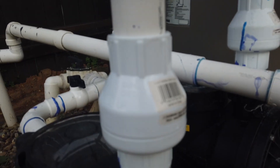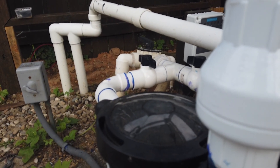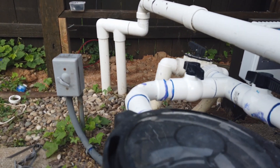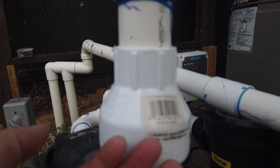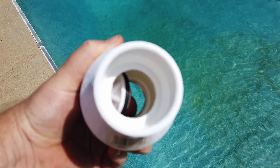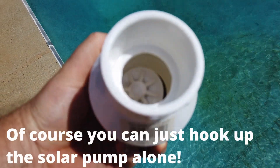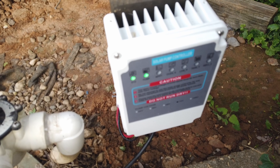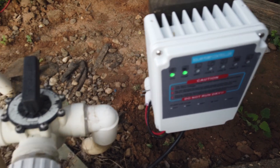I want to show you the connection of these pumps. I've got them in series with each other, with a branch coming off the main entry where I can turn the valve on or off. If I turn on the electric 220 pump, it'll push through this check valve onto the sand filter, and the flap will stop flow going the other direction. On the solar pump side, starting at 7:30 in the morning, it'll push up through to the sand filter. It comes up with the sun up, goes off with the sun down, and I've been really pleased with it so far.